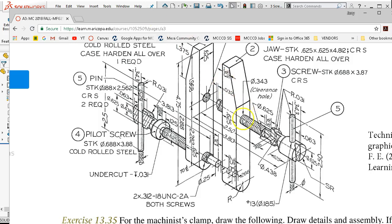To finish out the screw, as a general rule, chamfers and fillets go in at the very end — they're pretty straightforward and easy. I'm not worried about the amount of geometry in this case; we only have a couple things to add anyway. We have a 0.032 chamfer at the end, by 45 degrees.